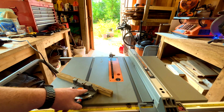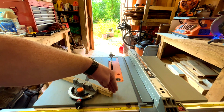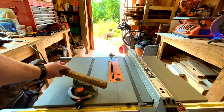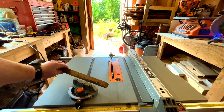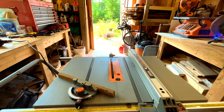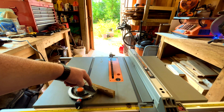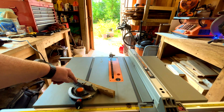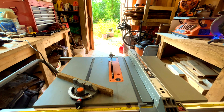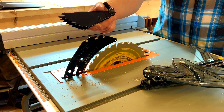There are two tracks on the back of the miter gauge which is good to note, because you can attach a longer board extension to give more height. If you're running a taller board at the top it can get rocky, so get a board with a track cut in it — you can buy these — and the bolt slides right in with a washer on either side to clamp. There are also adjustment screws if the gauge is slightly off.